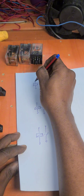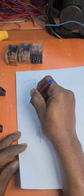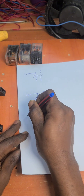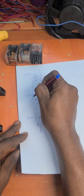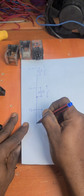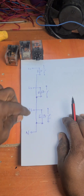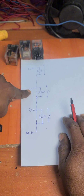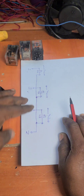In this particular relay here, it takes its power from L1. This particular one takes its own power from L2, while this one takes its own power from L3. To complete this circuit, we're going to connect these relay coils in series, all of them to neutral. So when we have power on L1, this one will close. When we have power on L2, this one will close. And when we have power on L3, this one will close.